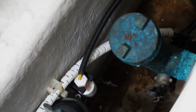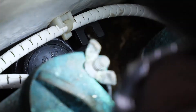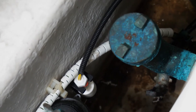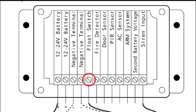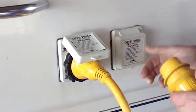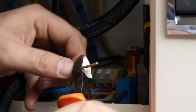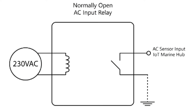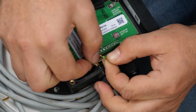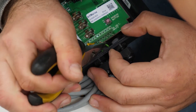To install it with screws, disassemble the float switch and assemble it again following screwing of the bracket. Make sure that the float switch is installed with its wires facing up. Connect one of its terminals to the float switch connectors on the hub, and another to the negative of the hub. Another example of a wired sensor you might use is to monitor the AC shore power supply. This can be done by using a normally open AC input relay. Power the AC relay by the shore power AC power, such that it opens its terminals as the AC power is disconnected, and shorts its terminals as the AC power is supplied.